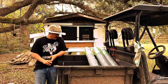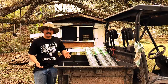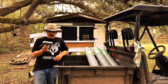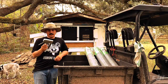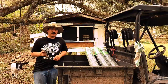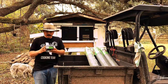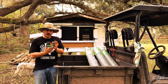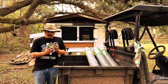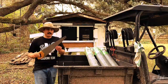And try to get this chicken coop closer to being finished. Just real quick, I'll go over some of the items. Tape measure, for measuring out the lengths I'm going to need for this chicken wire. I've got this staple gun, and I'm going to be using some T14 half inch staples just to secure it up and make it easier to work with. Then once I get it secured, I'll follow it with some 3/4 inch galvanized poultry netting staples. I picked these up at Home Depot, and I will reinforce it with these bigger staples to hold it in.